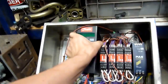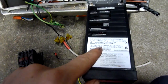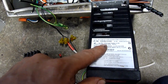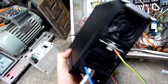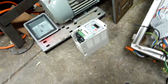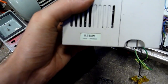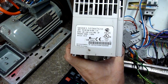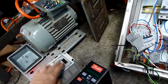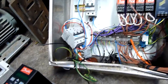The main reason I got this cabinet was for a Danfoss VLT drive — like a mini drive — but unfortunately this one only takes 380 to 480 volt input three-phase. I can't just plug this into single phase and expect it to work; it'll give me a phase error. So this is the kind of thing where I'd trade somebody for a single-phase drive or a motor or whatever — it's a bargaining chip. This one here, however, is a one-horsepower 230 single-phase input drive from Delta, which is a fantastic electronics company.